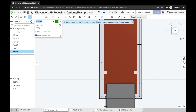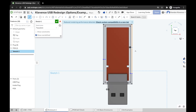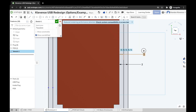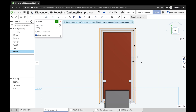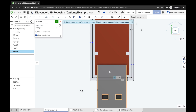I'm going to call this sketch 'Enclosure Guide.' This sketch may be edited depending on what you're doing, so you can make a variety of different enclosure types. I'll move these dimensions out here since we may need them later. To review: this area is the future wall of our case, this area is the air gap between the interior of the case and the circuit board, and these lines up here are the offset reference for where the USB plug will exit the case.